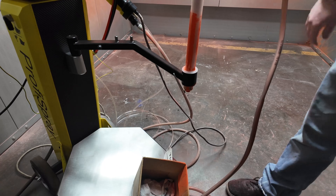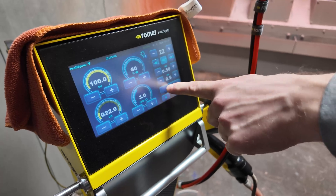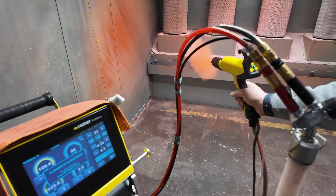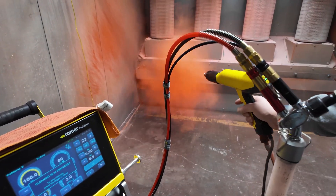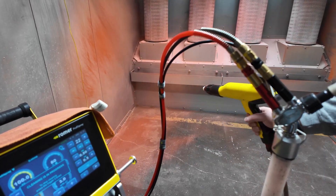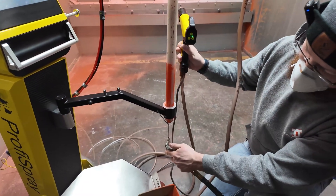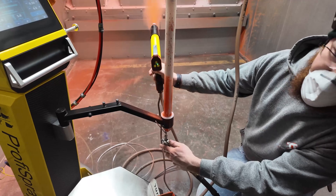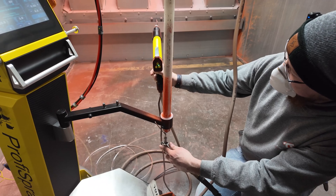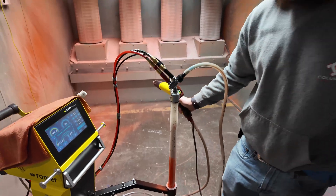On the control box screen, there is a broom button. If you hit it, this is the cleaning mode. When you take the spray gun and pull the trigger, it will start sending air through the pump to the spray gun to clean out the line. Also, while the support is holding the pickup tube, you can take your spray line from the bottom and push out a majority of the coat. As you can see now, most of the powder is out of there, so it's easier to clean in the long run.